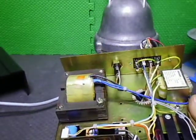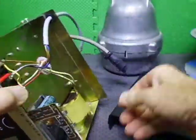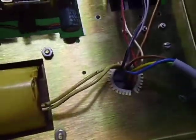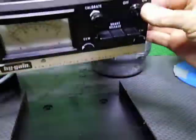I'll turn the other lights on — that's better. In here I had to do some cutting away of the sub-chassis to get around the capacitor. You can probably see the board a bit more — it's something I just made up and fitted in. I've also put a protector around the hole so wires don't rub, just to make it neater. The base has no rust, which is good. I've put new feet on it — they push through with little pin-throughs and are much better feet.